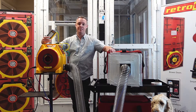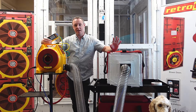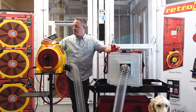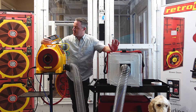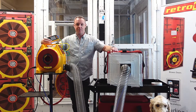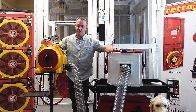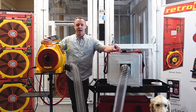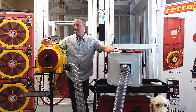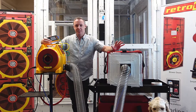The DM32 that comes with this system is actually called the DM3220. It looks identical to any other DM32 that we make that comes with our residential duct tester kit or our blower door systems, but this one has different sensors inside of it. The sensors are designed to measure pressures up to 20 inches of water, where the regular DM32 can handle up to 10 inches. We're dealing with inches of water here, so we need to measure more pressure and not as much at the lower end.